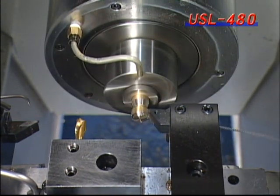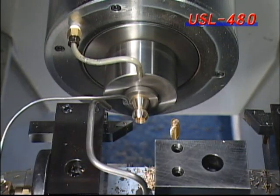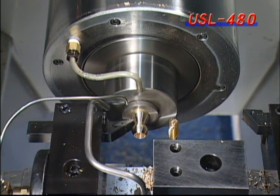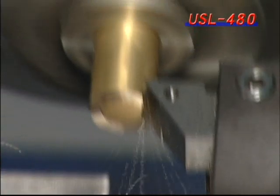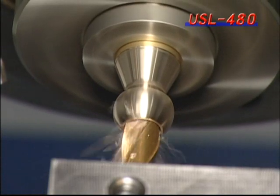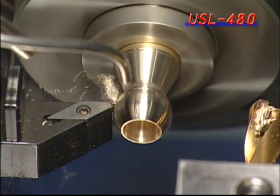With more tool space than the USL 300, this model is capable of mounting 4 standard tools. Despite the fact that it can maintain 160 mm x-axis strokes, it is amazingly narrow — only 480 mm wide. The use of this machine contributes to forming efficient, simplified, and flexible production lines, in which multiple machine operations by one operator can be easily performed. Furthermore, the built-in spindle with the zero-center design minimizes the relative displacement of the spindle unit, thus improving accuracy.